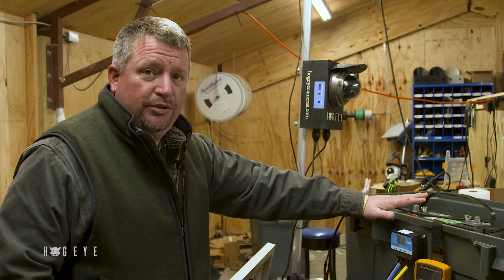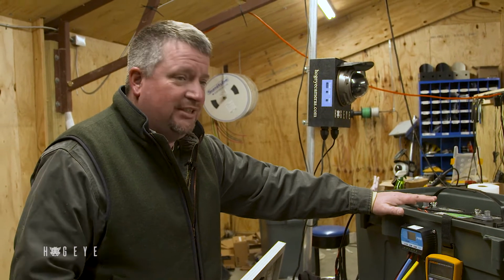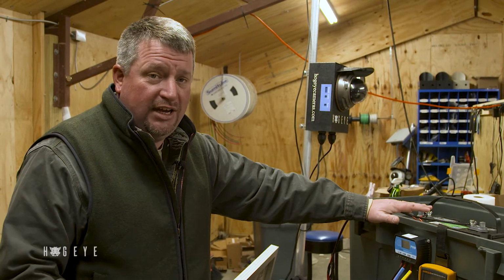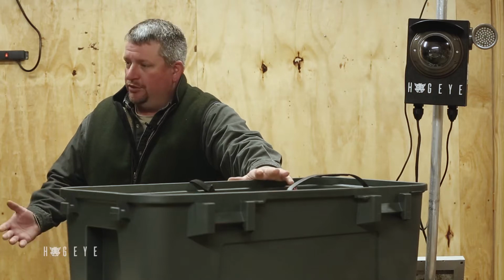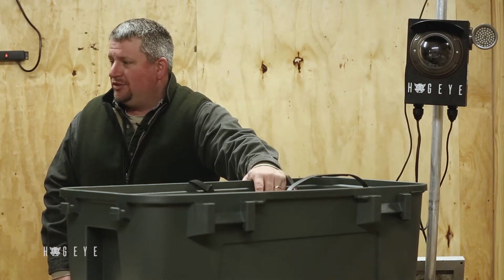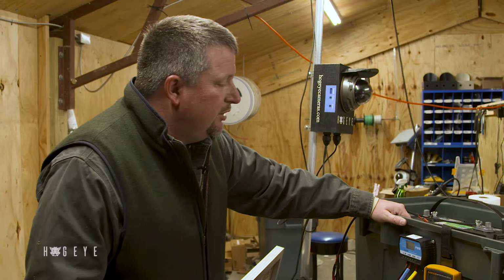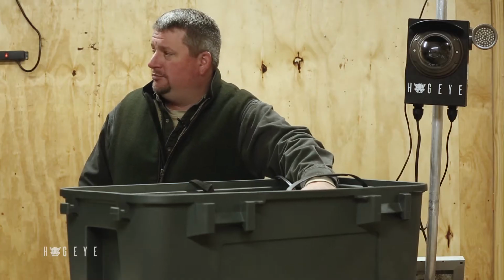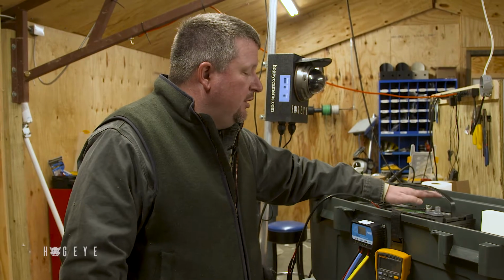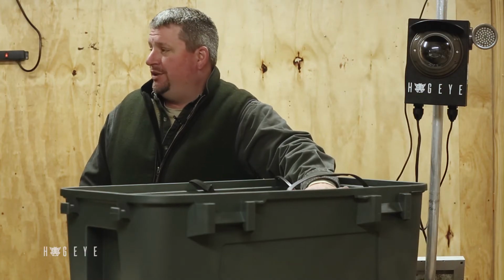The system is designed so that 2.5 hours of direct sunshine will keep this system charged. Now, of course, in the wintertime, your quality of sunlight is down. Summertime, it's better. So anyway, if you start with a 12 volt group 29 battery, which is what we recommend, those batteries should easily last you a year.